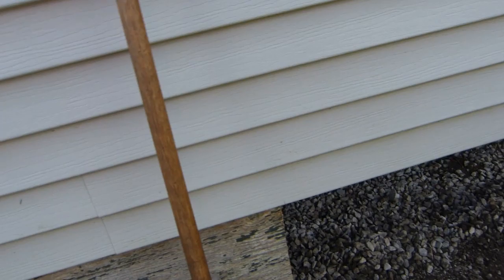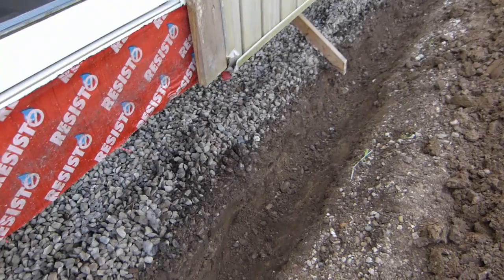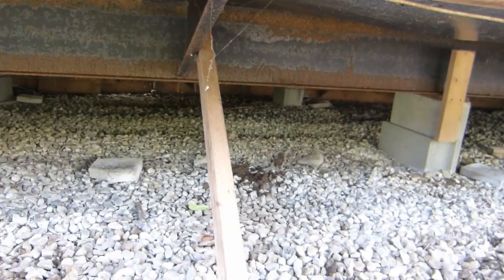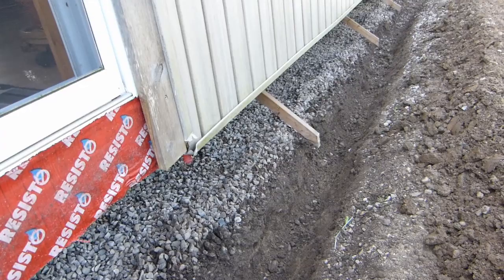I figured the plywood lasted 14, 15 years, so I definitely thought my days of working at the end of a shovel were gone, but here I am digging a trench. I've got some diagonal pieces hanging down and they're attached to the outriggers, and that'll be for the bottom support. The trench is to prevent rodent infestation and frost heave.